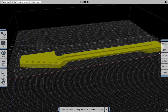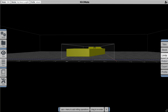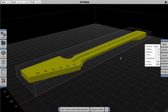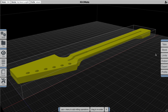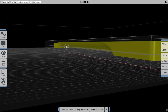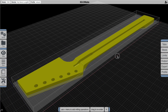The first thing I do is ensure that my stock offsets are set up either absolute or relative depending upon how I'm going to do this job. We can see that this part is set to the middle as opposed to the top or the bottom, and the reason for that is we're doing a double-sided job and that's usually the best way to do it. Also, because this is a double-sided job we're going to want to establish a plane which we're going to cut down to from each side — in this situation that's going to be called the Z bottom. When you set it in 3.5 you get a visual plane that shows you where you're going to cut down to on each of the flip operations, and this is new — the visualization was not there in 3.4.